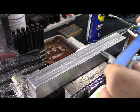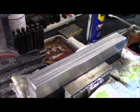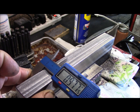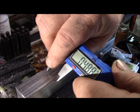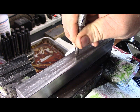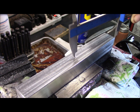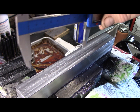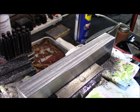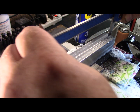I'm pretty close to eight inches but just a hair more, so what I'll do is find my center. I got .979, .977, .977 — half of that is .488, so my exact center is right about there. All I need to do is find my hole-to-hole dimension, which is seven and three-eighths — that's 3.687 each side from center. For the short action it's six and a half, so I'll mark that one down here and go six inches plus another half.